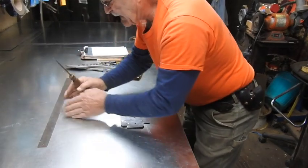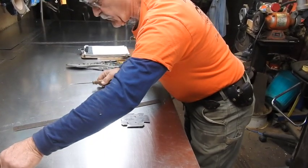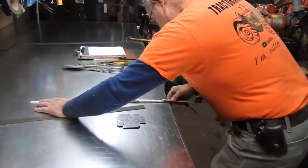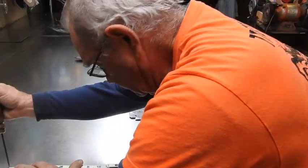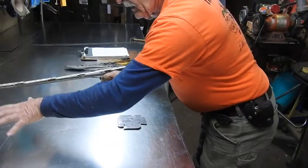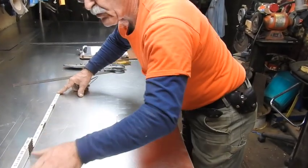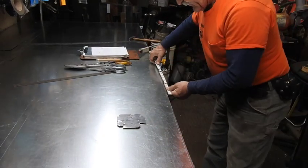We're starting off at the inside radius of the fitting, but we know we've got the width this direction and that direction. We know then that the top portion right here is going to be the 20 and a quarter plus the four-inch throat. The inside quarter inch, this will be the outside inch, and down here we're at 24 and one quarter, which is exactly what we figured. So if I mark down one inch — 23 and a quarter — that's going to be our S or drive connection. So I can come out here and go 23 and a quarter and 24 and a quarter. There's our 20 and here's our 20. We have to locate the outside edge: because it's a four-inch throat, we're going to go four inches out from the inside quarter-inch mark. That's going to be 4 plus 20 and a quarter, which is 24 and a quarter — and then back one inch off of that for the S and drive.